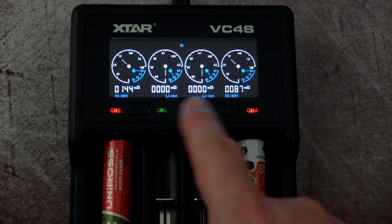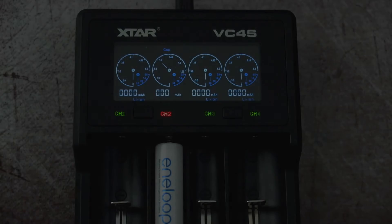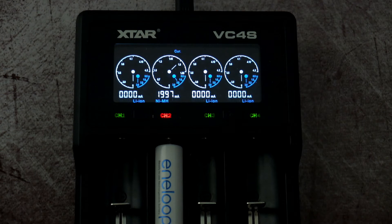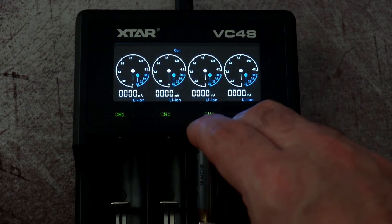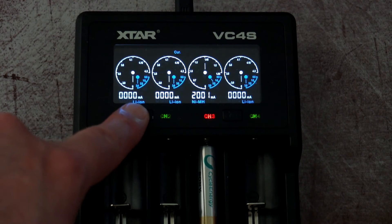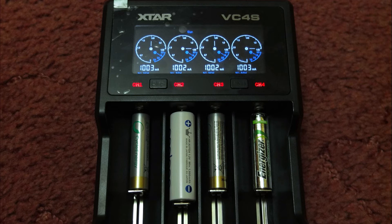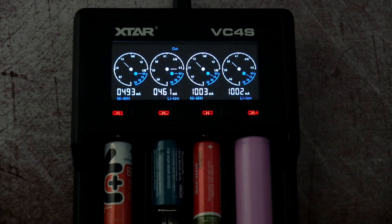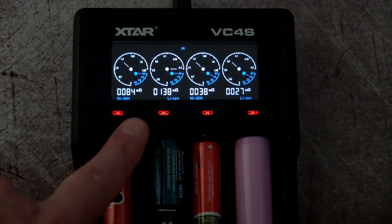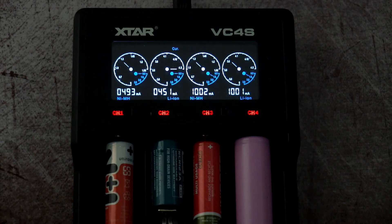For nickel metal hydride, you get the flashing display for a couple of minutes during soft charge, then it goes to full charge rate. With older cells and slightly higher internal resistance it picks around half an amp, which is fine. But with a new Eneloop in good condition it wants to charge at 2 amps — that is way too high for an AA cell. Inserting a fairly new Sony AAA battery with low internal resistance, it also wants to put 2 amps in. That is not an acceptable charge rate for AAs and definitely not for AAAs. This happens consistently with new cells when using Quick Charge, and there's no way to stop it without dropping to 5 volts.